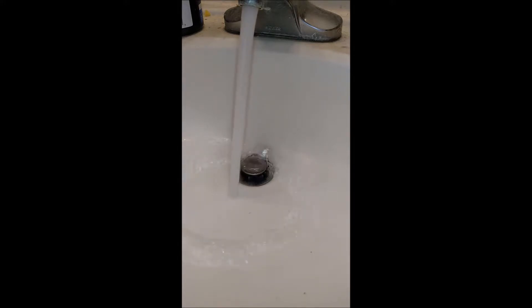I believe that's the key — the resin beads in the water softener are moving around when the water is flowing and they're starting to plug up the ports for the exit of the tank. Now it's been about 15 seconds or so, and actually this time it's working pretty well. We'll try something though.